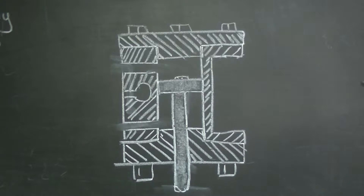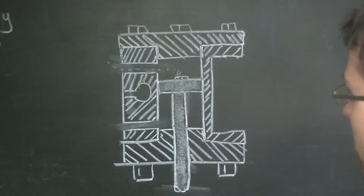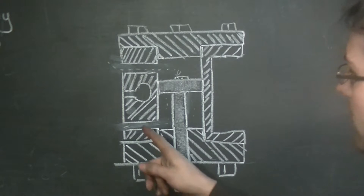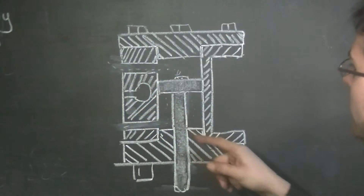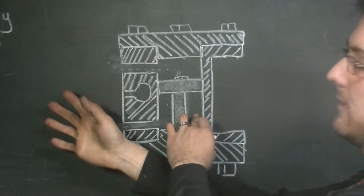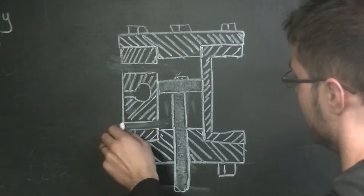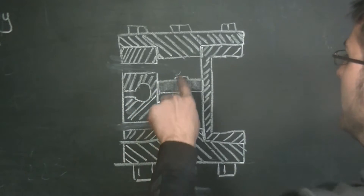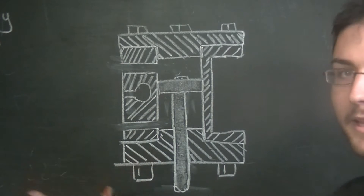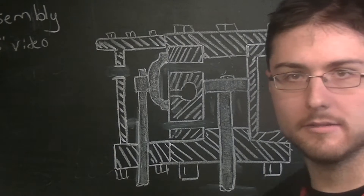There are a lot of different designs, but this is the simplest one. Essentially how it works: steam comes in from the top and pushes down on the piston. The piston gets pushed down and all the excess steam gets pushed out through the passageway, which is attached to exhaust. When it gets to the bottom, the mechanism reverses — the top is now attached to exhaust and the bottom to steam, pushing the piston upward. It just goes back and forth. The heart of the steam engine is the piece on the side that controls steam flow.